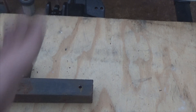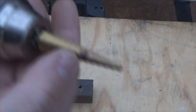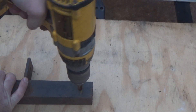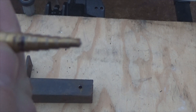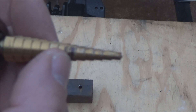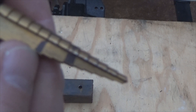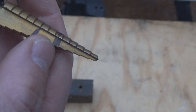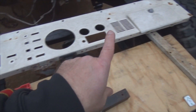See how fast that was? Now for demonstration purposes, I'm going to drill one more step so you can see what it does to the marking. If you're doing a lot of repetitive drilling at different diameters, you'll eventually lose your outside markings. But here you can see our inside markings are untouched. So mark on the inside steps for multiple diameters — you can see the markers as it's spinning; it creates a little black stripe as the bit spins.